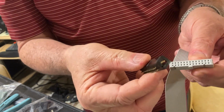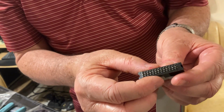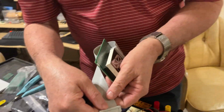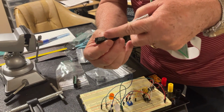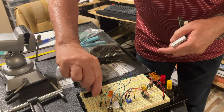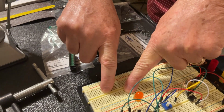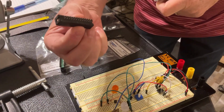Now, what is the problem with that? If you just solder it on a printed board, there is no problem at all. The problem arises when you need to check a project, like this one being a big digit, it needs a flat cable. When the flat cable has to come onto the breadboard, the pitch for the pins is 0.1 inches or 2.54 millimeters. So when you try to plug it on the slot, it won't fit, simply because the distance between the two rows across the slot is 0.3 inches or 7.62 millimeters, okay? So for that reason, you cannot use that kind of counterpart.